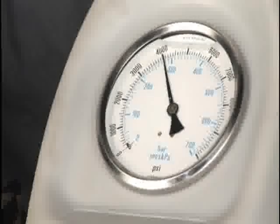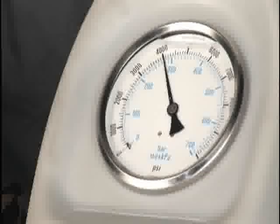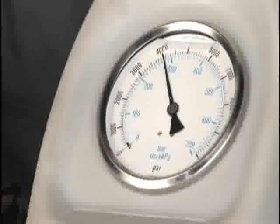Now, until the pressure is readjusted, the Avanti 3 tool will tighten until it reaches 1,166 foot-pounds of torque, plus or minus 3 percent, or about 35 pounds one way or the other. But if one bolt is 20 foot-pounds high, they will all be 20 foot-pounds high, and consistency of torque is usually much more important than how accurate the number is.